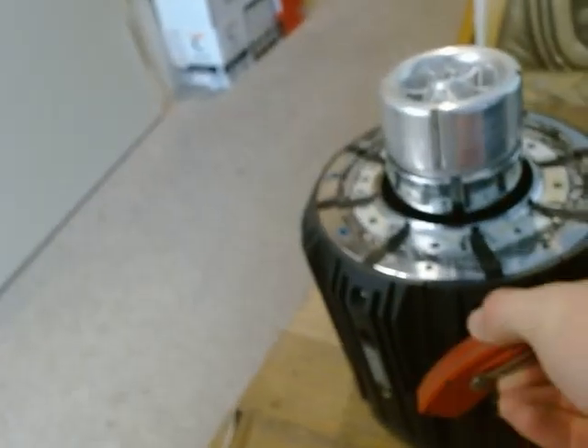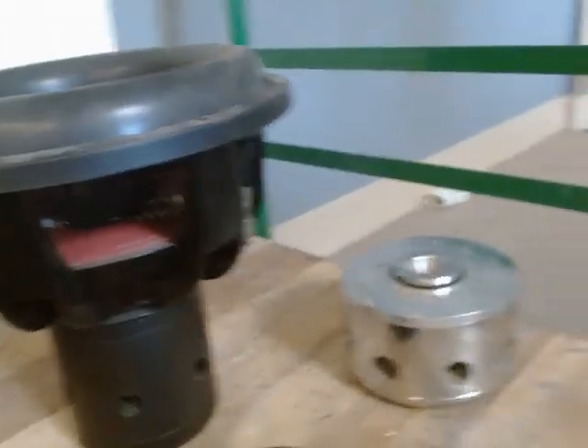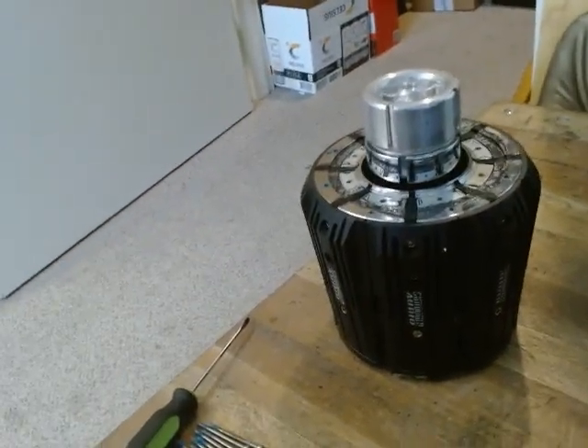Here's another cool thing I want to show. The NSB6 has very, very little stray flux whatsoever. Check this out — this is a Z8, a standard variant motor. NSB6: nothing. V5: nothing. V4: nothing. Original prototype: nothing. But inside: huge amount of magnet. Same thing with the V5. There's no waste, none of it goes to the outside — no stray flux. It's all very concentrated. That's how we can use this small amount of neo and get more motor force.